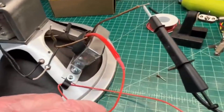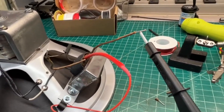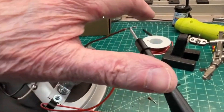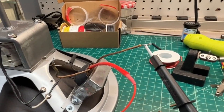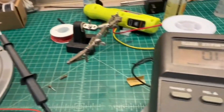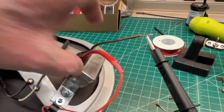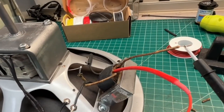You can see me doing the lead dress for the primary side. Center tap: red. And you saw where I just checked DC resistance from center tap back to each side to confirm inner winding versus outer winding. And now I have an open primary. A new transformer would make most sense — this thing was pretty rusty, and there may be some more damage in here.